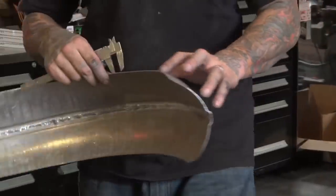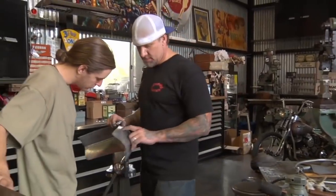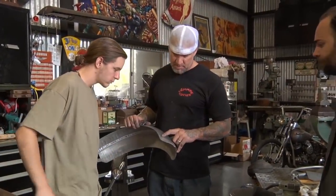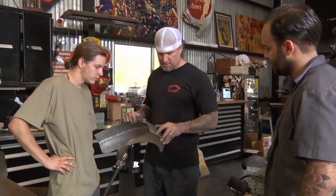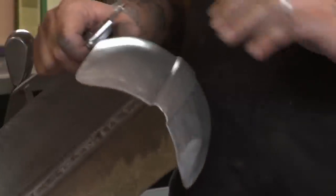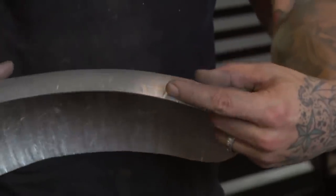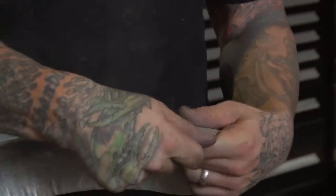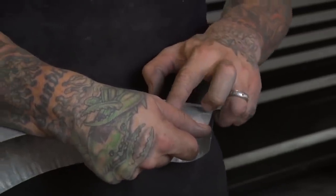So that's where we're going to end up. We'll scribe the inside of it, but you guys can see. So what we have to do is go straight along the edge, and turn this edge in so we end up right where we want to be. And this is going to disappear. So this is all you're going to see. Your rolled edge should complete that radius to that.